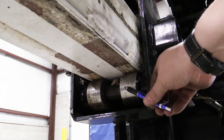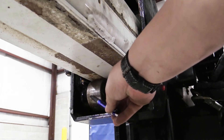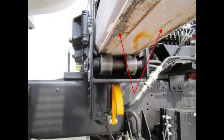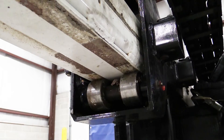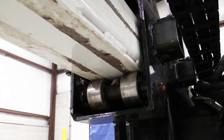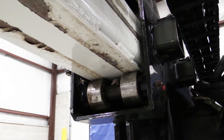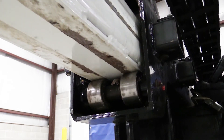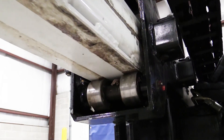The arm slide tube also has two bottom rollers that must be inspected. If any area of the roller track on the slide tube bottom is worn deeper than 3/32nds of an inch, the roller wear plate must be replaced. Verify that both rollers rotate freely and are free of any flat spotting or damage.